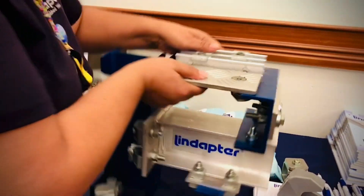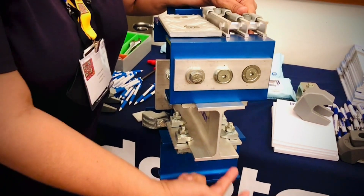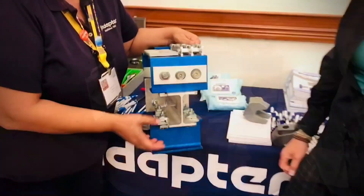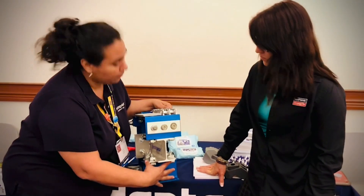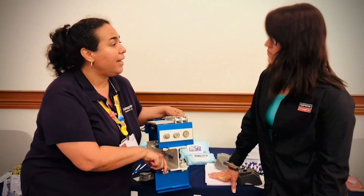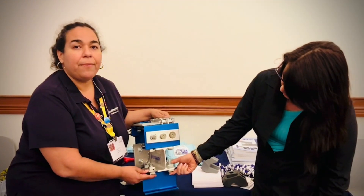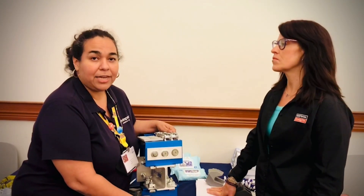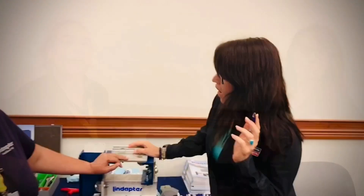If you're trying to hang a piece of steel to another piece of steel like this, normally you're going to be drilling, or you're going to be welding, or drilling and bolting this connection. With our clamps, you can actually just bring in a fabricated plate that's oversized, drill your hole just outside of that flange width, and then clamp onto the top and the bottom of that plate to get a fully rated connection for vertical or slip connections like you're seeing here.